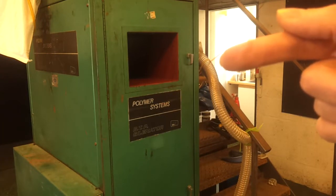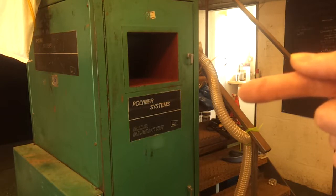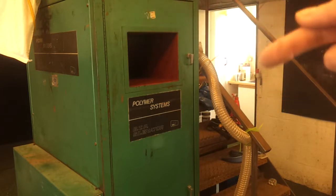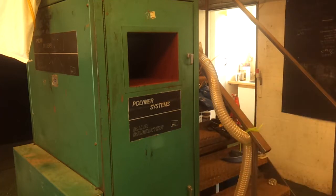Normally you would tie the blower into something called a cyclone, which is basically like a hopper — just a big drum. The plastic comes in from the side, swirls round, and all the granules drop out the bottom, very much like an industrial cyclone, a Dyson vacuum cleaner kind of affair. I haven't got one on this machine because I don't really need it, but if you're granulating an awful lot of material it makes no sense to be taking it out of the bottom bit by bit — you just keep chucking it in, blow it up through a hose into a cyclone, and then down into a bag.